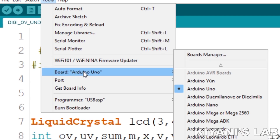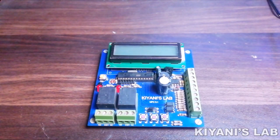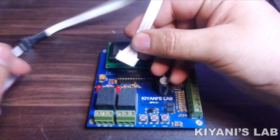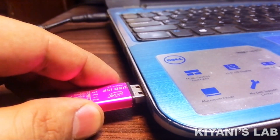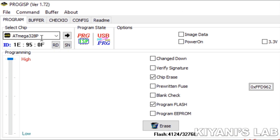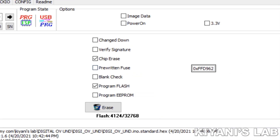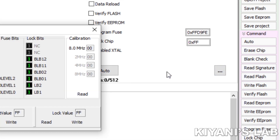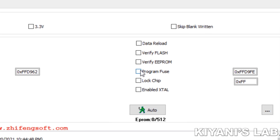Now let's make the hex file and burn the code to the microcontroller. The programmer I'm going to use is USB ISP and the software is ProgISP. Open the software and select the chip, which in our case is ATmega328. Click on the RD button — if you see the message 'Read ID successful' then we are good to go. Now click on 'Load File' and select the hex file. After that click on 'Erase Chip' and then click on 'Write Flash'. Now click on this button to set the fuse bits — set low fuse bits to FE and high fuse bits to D9, then click the Write button. The program is now uploaded to the microcontroller.